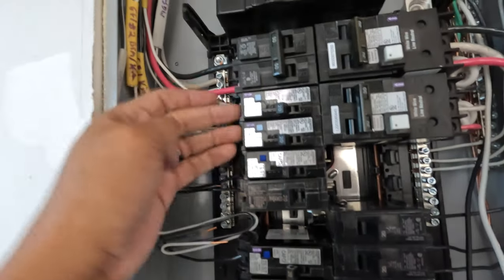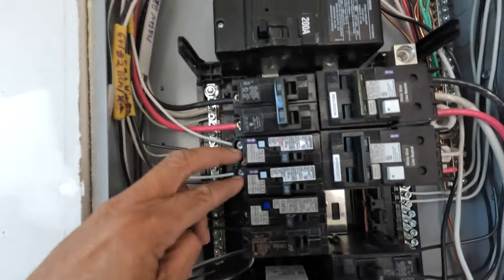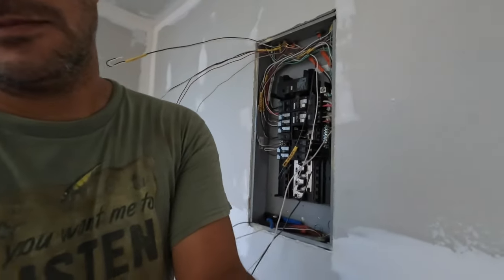I have the fire alarm circuit left, the front receptacle GFI, the air conditioner, the washer, and the living room. Some of these need to be arc fault, some need to be ground fault, and some you can do a combo arc fault/ground fault. I don't need arc fault in the kitchen — you do need a ground fault — but arc fault is needed on pretty much every other 15 or 20 amp circuit normally run in a house, not in the bathroom or kitchen.